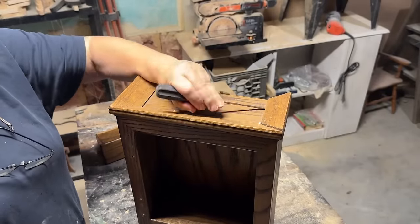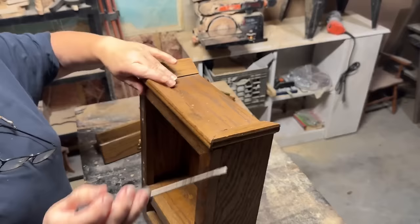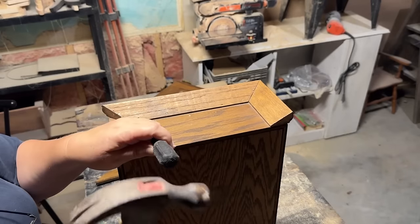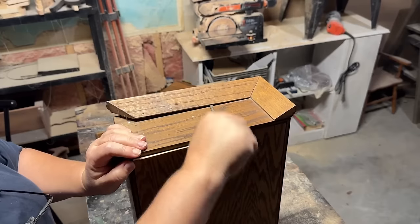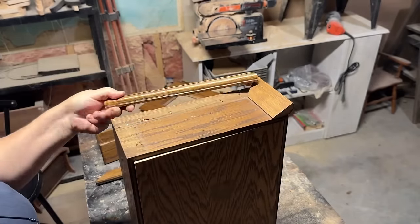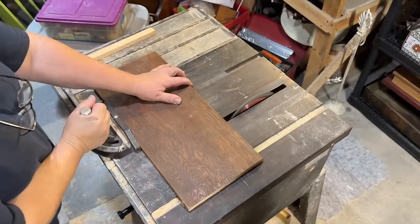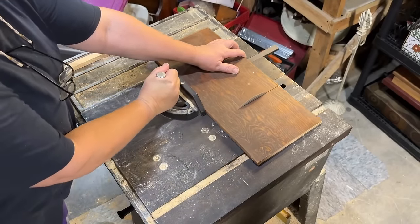Now I'm taking a hammer and flat screwdriver and I'm prying off that top piece where the molding is. It's just very dated with that molding and I wanted to do something more in a straight-lines primitive style. So I'm going to take these off and find a piece of wood that will fit the top — and I actually found one. I used my square and made a nice line so that I could follow it and cut a piece with a little bit of an overhang on the front and the sides.